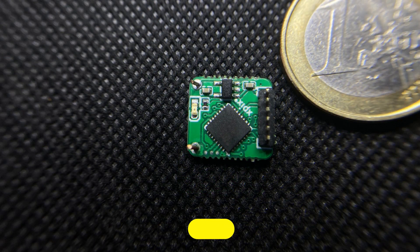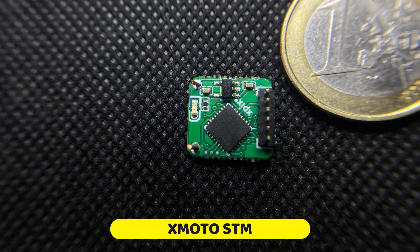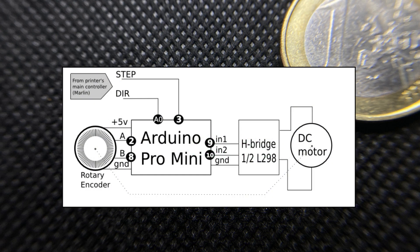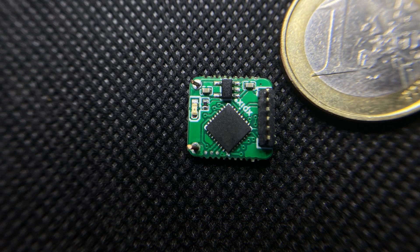Now, how do we turn a DC motor into a stepper motor? This is done by the second board, connected to the driver via large contacts with plus and minus as well as a plug-in socket strip, called the X-Moto STM. A microcontroller is installed here which takes over the task of a stepper motor driver. At one input it listens to the step impulses, at the other to the direction signals — step and DIR — and moves the motor via the motor driver accordingly. It constantly compares whether the motor is in the correct position; if not, the position is actively controlled. So it is a servo function that always corrects the motor position. The signals between the boards are transmitted via a 1mm pin header, including sensor signals and PWM signals.